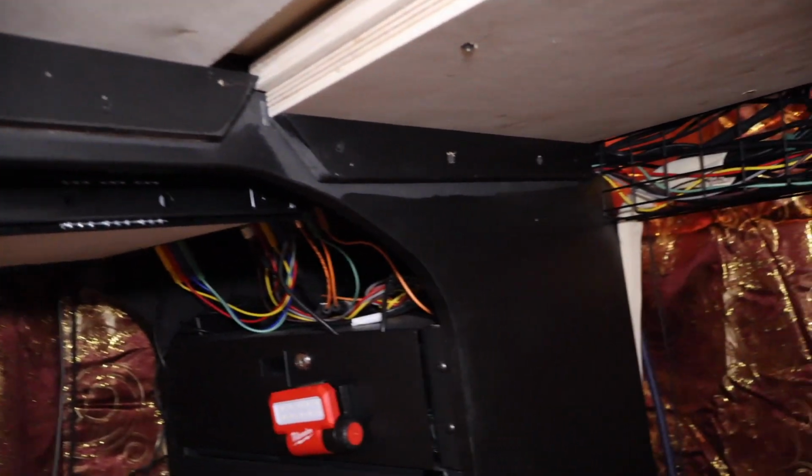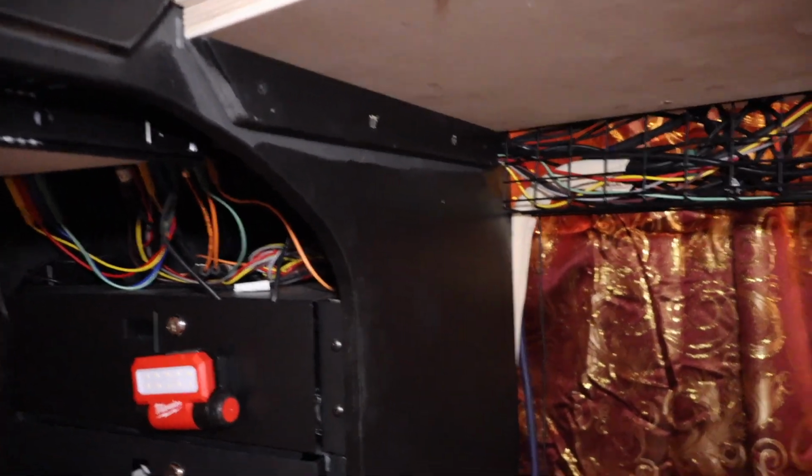Now you can see here I built these brackets and screwed them into the sides for the writing surface, and you can see where there's two layers. The first layer I put down, I screwed directly down into the wood bracket I made. The second piece, the piece with the Formica on top, is laid right on top of that. I couldn't access that area from the side pieces, so I had to screw from the bottom into the top. That pulled the top layer with the Formica down and secured it to the other layer that was already secured to the bracket. I hope that makes sense. You can see a little bit of the screws where I screwed it down, and that made it a lot firmer.